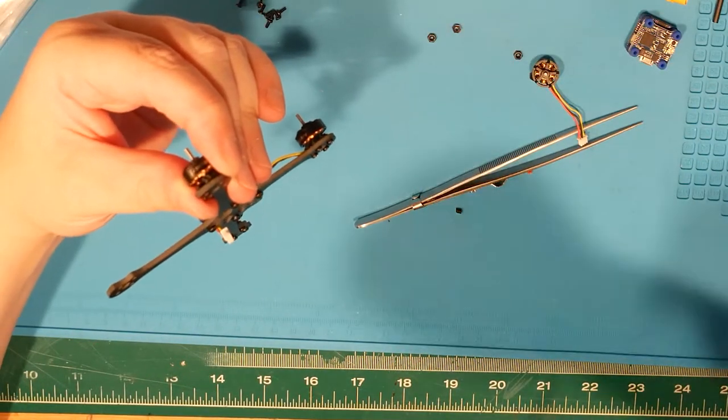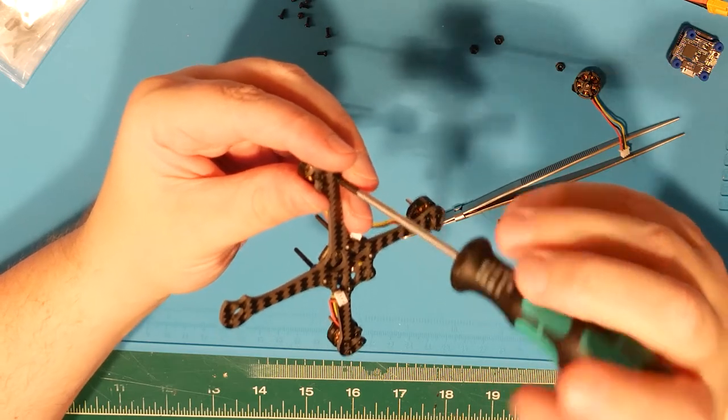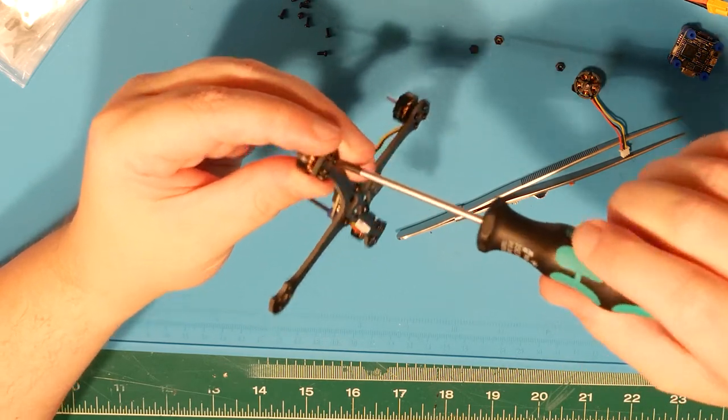Then it said, oh, you need motors. And I bought some 2212s for this 10-inch prop thing. 10-inch props. And so it really is kind of like a DJI clone. It's really not terrible. But I haven't done anything with it other than test hover it. I never got a camera on it. The KK2 is not really an FPV thing. It's never designed for holding a camera, as far as I can tell. It lets you control gimbals and other things like that, but not much else. And it was conceived in 2012 or 2011, so it's sufficiently old compared to a $40 flight controller from, you know, GetFPV.